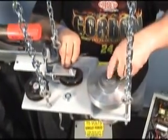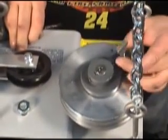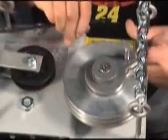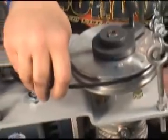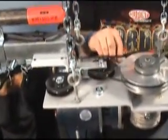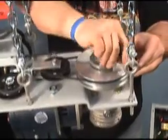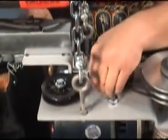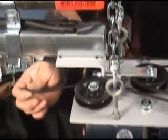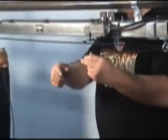Once at the machine, loosen the driving dog thumb screw until it completely clears the drive wheel. The drive wheel should spin freely. Start wrapping the cable around the drive wheel, filling the top groove of the wheel first. Continue by threading the cable around the tension pulley as shown. Now wrap the cable around the drive wheel using the bottom groove of the wheel. Next, thread the cable between the idler wheel and the machine mounting bracket as shown. Pull the cable to the center overlap of the track system and thread it through the 1709 end stop on the dead end half of the system.